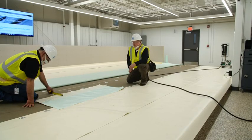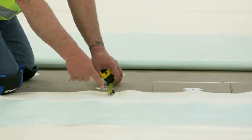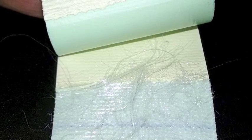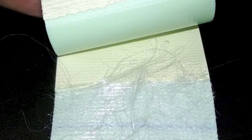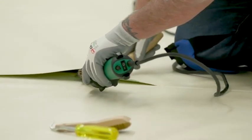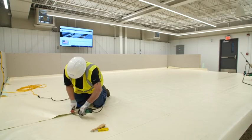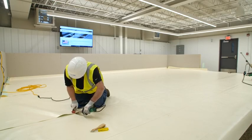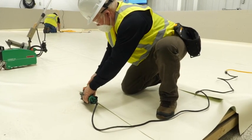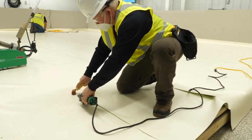All finished seams will exhibit a homogenous bond a minimum of 1.5 inches in width. Checking actual field welds can be accomplished by removing a nominal 1.5-inch section of the weld and doing a T-peel. Once the hand welder is verified to have achieved the optimum weld, start the final seam weld at the stop-start point of the auto welder. Weld the back interior edge of the membrane with a thin, continuous weld. This will concentrate the heat along the exterior edge of the lap during the final welding pass.